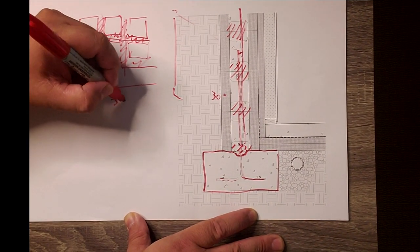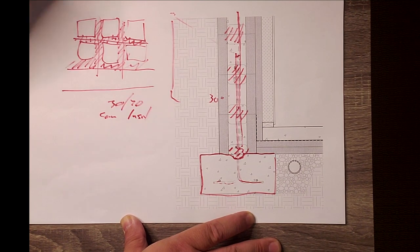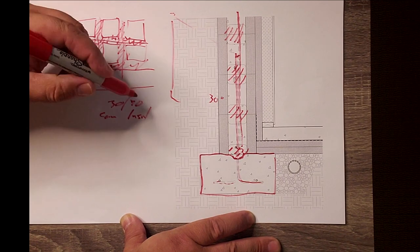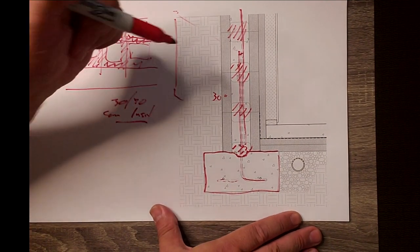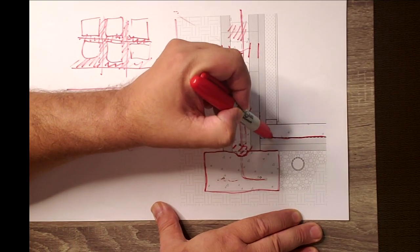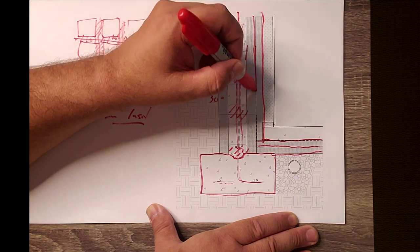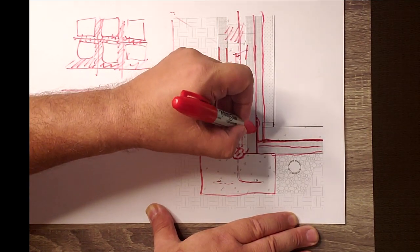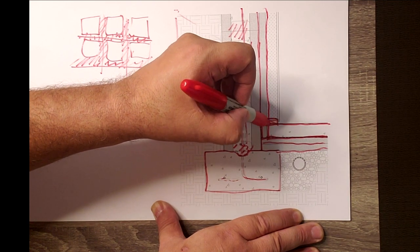One of the beauties of this block is the 30/70 relationship — 30% concrete, 70% insulation. This allows you to take a full foundation wall, eliminate 70% of it as concrete, and enhance the system with insulation — hence the 'Perfect Block' name. In addition to the block's insulation, they chose to run 4 inches of XPS underneath the slab system and 2 inches up the wall, then a 10-mil vapor retarder taped off, then a concrete slab, and a 2x4 mud sill with sill seal sealer underneath.